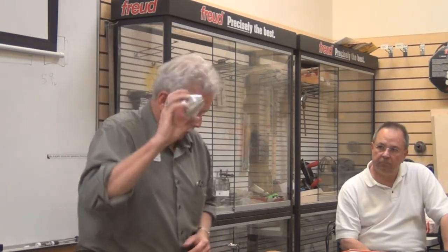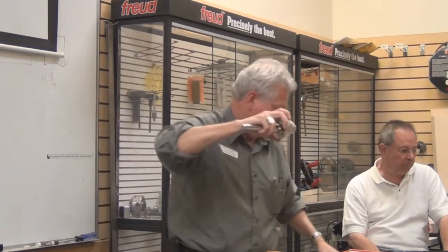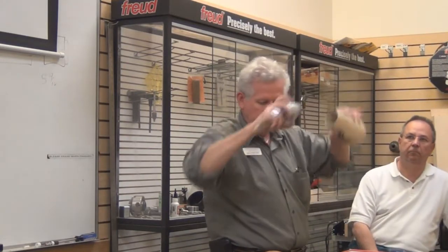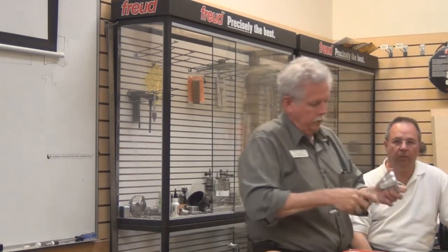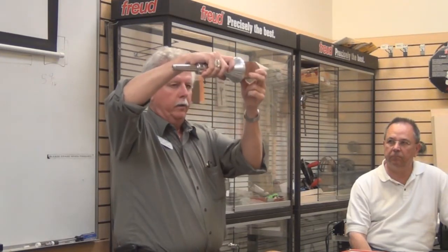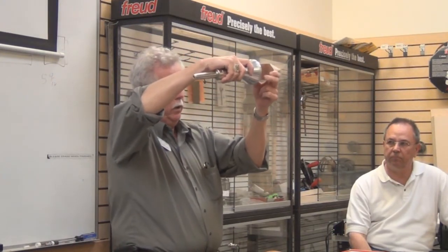People do that. Now, with the One-Way you also get the bigger cone. So that's another way for the jam chuck. I can take this end off and I can either put that in a bigger opening piece like this, and now that rotates freely because it's on the ball bearing center. Or you can turn it around and it'll mount like this. So if you're doing spindle turning, you can have a live center, you can have a jam chuck like that. That is a really nice live center.